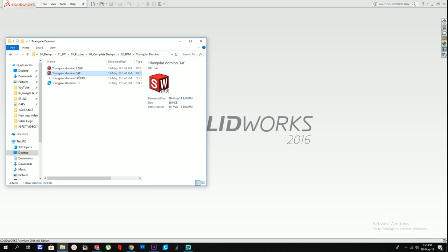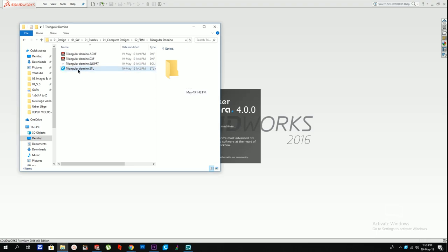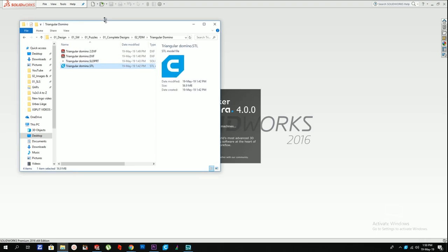Now I'm going to put the two sketches on the left and the puzzle on the right — that way it's easier to work. I can make it take up less space on the plotter by turning this 60 degrees and putting it horizontal. Now I'm going to put dimensions just to be sure I'm on the right scale. I don't know exactly how my sticker plotter works — I haven't received it yet, so I'm filming this before receiving the plotter. I'm going to save this as a DXF file, which is what most plotters use, including my Silhouette plotter.